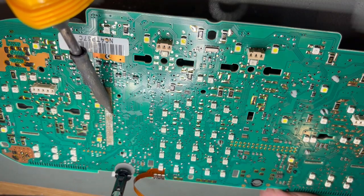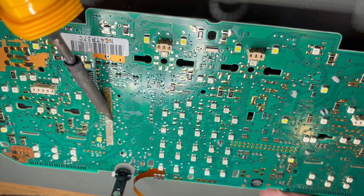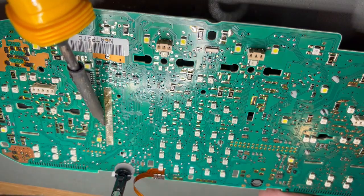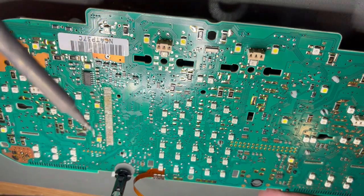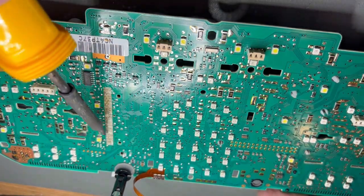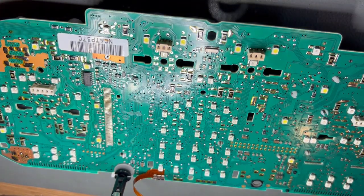Here we've got an old pin off the old display. Heat this up and it will just slide off and raise on the tip — we can remove that. Here's another one that's got some old material on it. Again, just slide it off with the iron — it sticks to the iron. Wipe it off into the cleaning pad and keep going through. With the magnifier it's easy to see whether there are any shorts before we put the new display on. We've now got nice clean pads, none are damaged, and they're ready for the new display to be soldered.